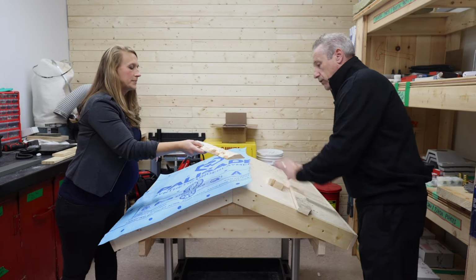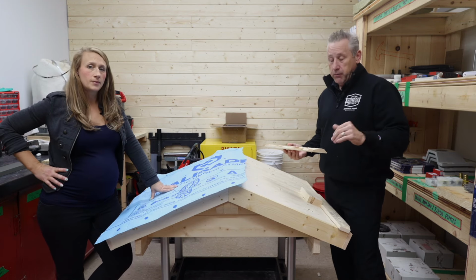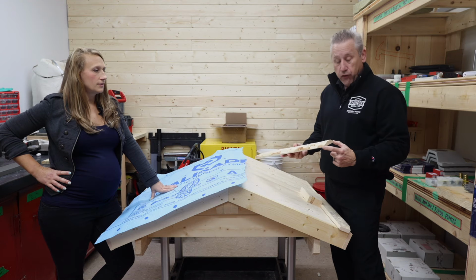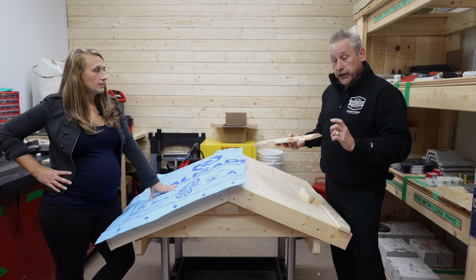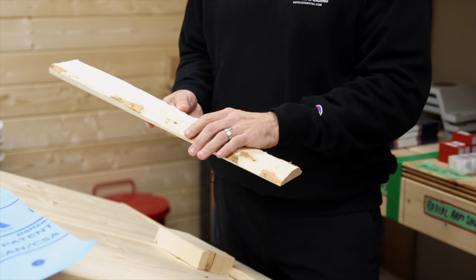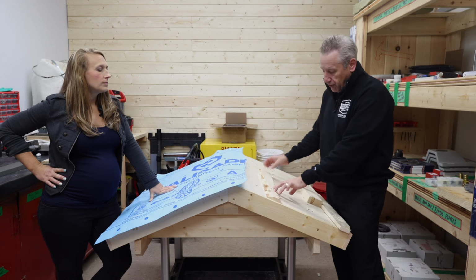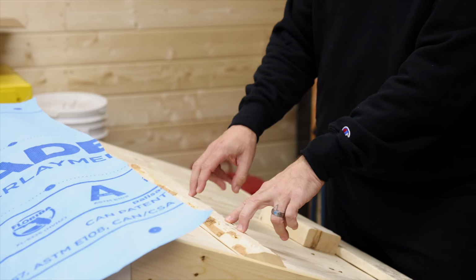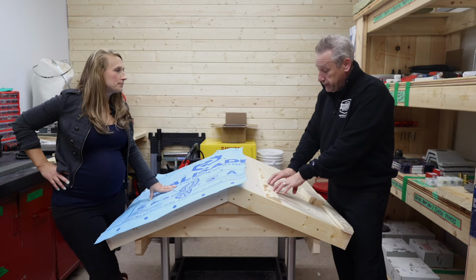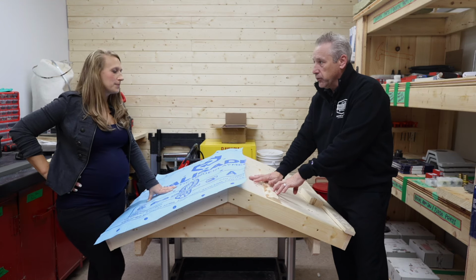Okay. As it relates to strapping, there's lots of variety on the market. This one here is a rough strap, which is 4 inches wide and 1 inch high, like ours is 4x1. But being a rough cut, you get rounded edges like this that are rough and edgy. So not ideal. If you're looking to find that exact nice flush piece for your screw, you're not going to find it as easily, not when you have a roof piece over top. And when you're walking on the steel, you can get a little bit of dentation or engraving in there. We want to avoid that if we can.